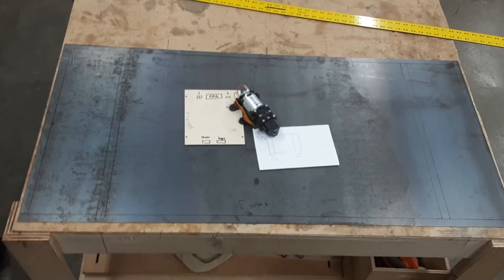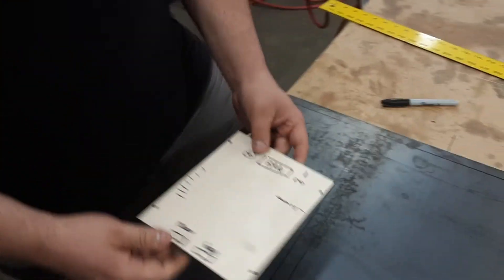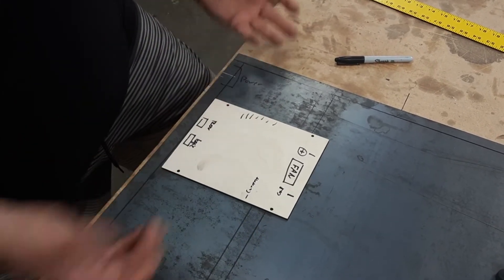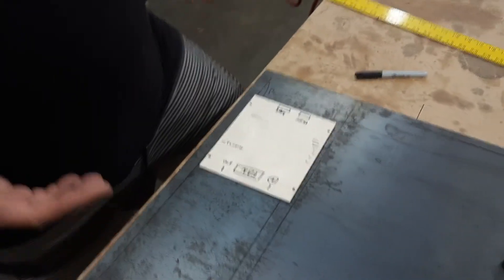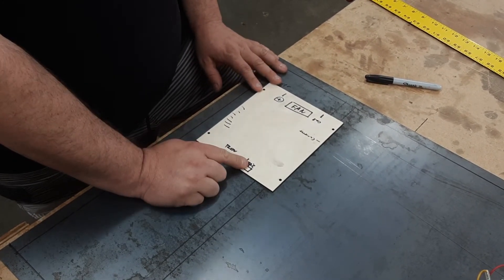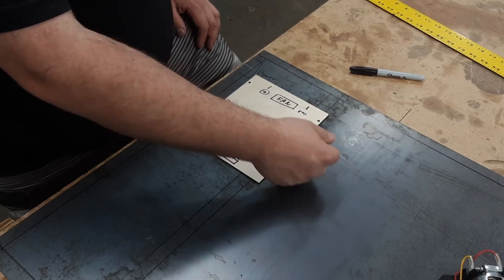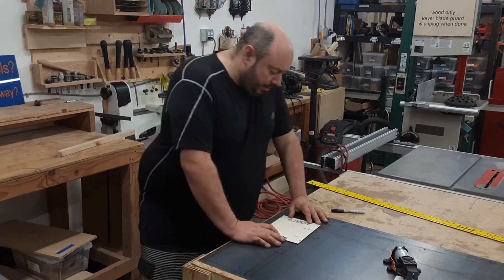Since I don't have a CO2 power supply on hand, I made a template of it — next video I'll actually have it in hand. It's actually a pretty big item, and if I push it right against the rail it still goes underneath, so it's a pretty big piece. We've got to decide: do we mount it like this? That wouldn't fit right, so it's definitely going to be mounted this way. On one side it's got 120 volts input and all the logic input; on the back side it's got a fan that keeps itself cool, the laser power, and the laser ground.